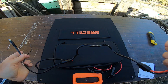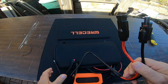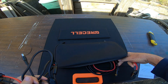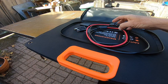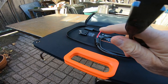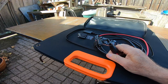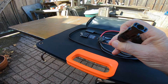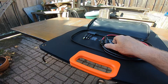This is some kind of Y connector where everything is connected together. Alright, so this is my first solar panel and I just learned a bunch of stuff reading online. These are MC4 solar panel cables — that's a standard, industry standard connector. If we had bought an EcoFlow solar panel, there would have been a connector going from this MC4 standard to the XT60, which is apparently the only way you can DC charge an EcoFlow Delta II.